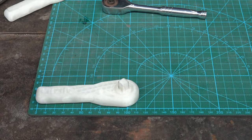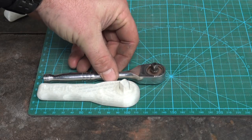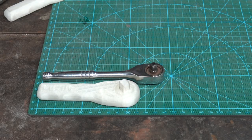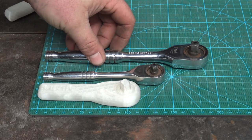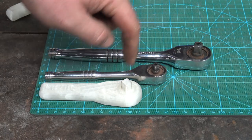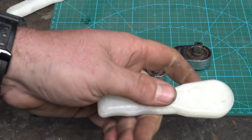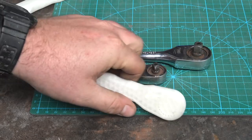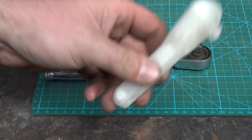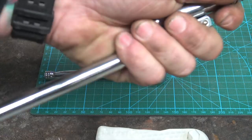They're coming in just past 110 millimetres versus a standard average-size quarter-inch at 145, almost 150, and a 3/8 coming in at almost 200 millimetres. So it's interesting that the handle length is probably by design - not only to save material but to limit the torque multiplier you have in the lever between the force put on here and the pivot. It's only rated 3 inch-pounds, so there's no point giving you a one-metre handle and a cheater bar.